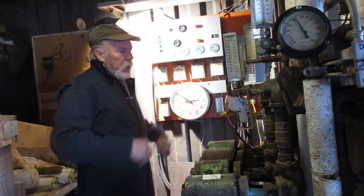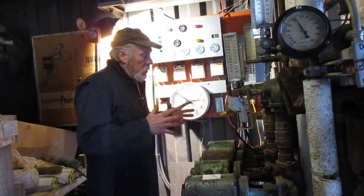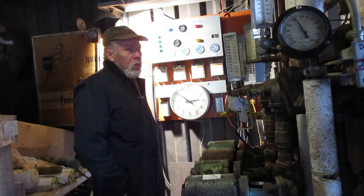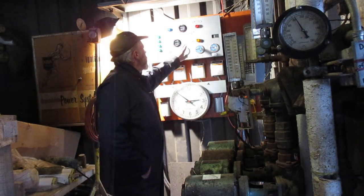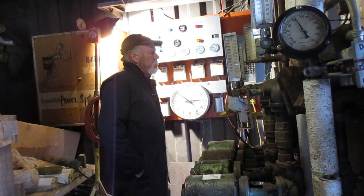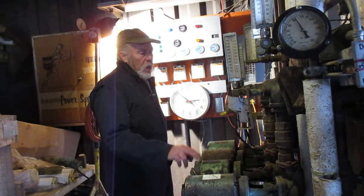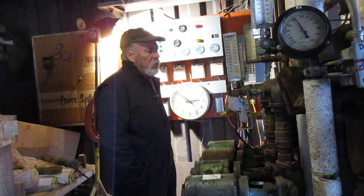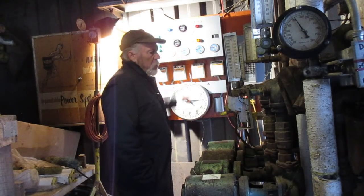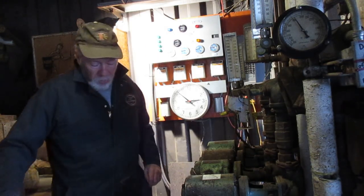This aquastat up there is a dump zone. As big as this boiler is and as efficient as it is, when it shuts down the temperature comes down, but there's such a big bed of coals that sometimes it overheats when there's no demand. Right now it's about 32 degrees out here. This line will come on — an orange caution light — meaning the dump valve. I can put the dump on any zone I want. Right now I have it dumping into the greenhouse, and I'll have an hour meter on that to see how much heat I'm wasting.